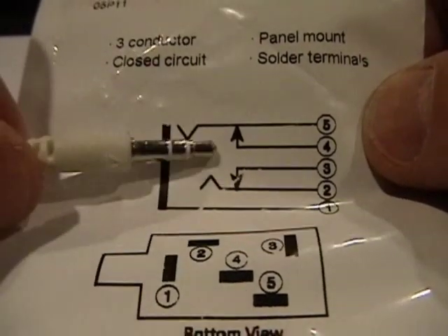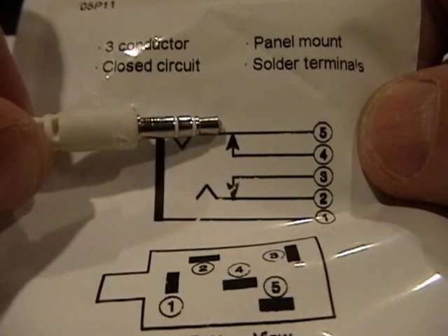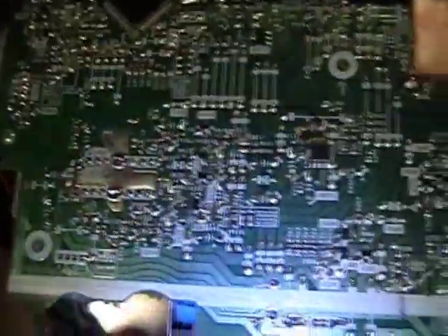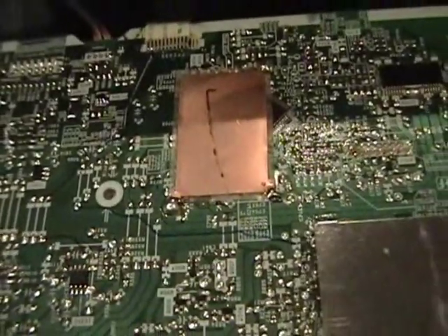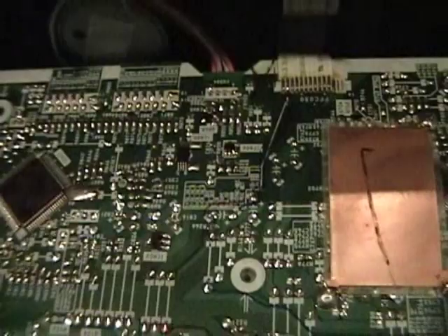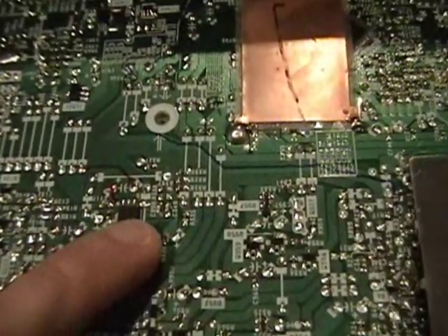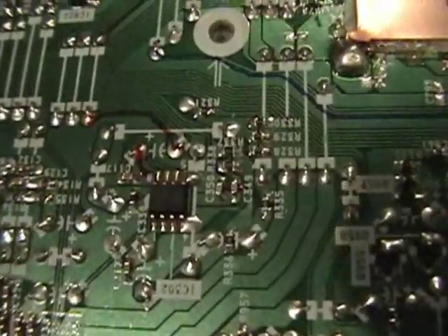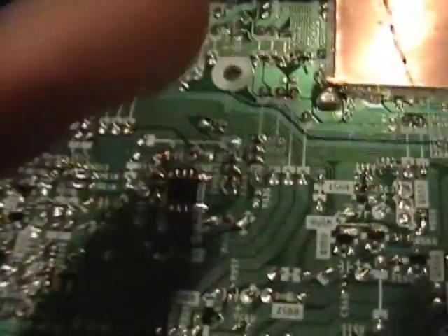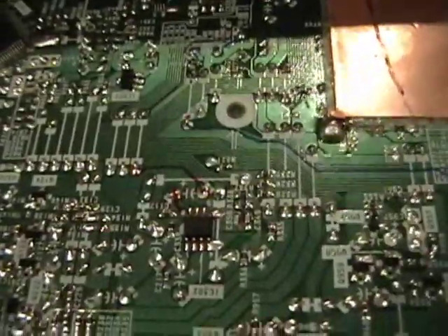So when I plug in the cable from the MP3 player, it'll break the connections and send the MP3 right down 5 and the MP3 left down number 2. I poked around on the board trying to find where I can tap in with the auxiliary, and this chip here looked like it might help me, but I could not make out the part numbers. It's discolored from heat or bad printing. There were definitely a couple 2's in it but I couldn't make out the rest. It looked like the tape and CD stuff all comes to this chip and then goes over to be amplified. I couldn't figure out the part numbers, and that was bumming me out.